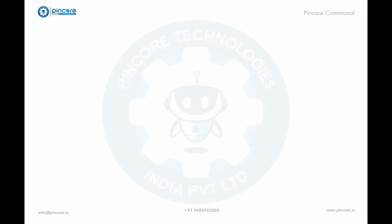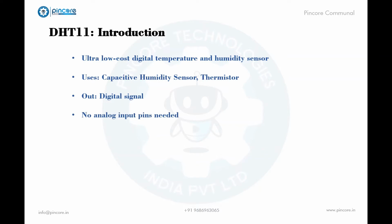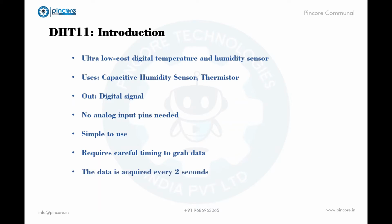So now let us discuss the introduction of the DHT11 sensor. The DHT11 sensor is a basic, ultra low-cost digital temperature and humidity sensor. It uses a capacitive humidity sensor and a thermistor to measure the surrounding air. It spits out a digital signal on the data pin, so no analog input pins are needed. It's very simple to use but requires careful timing to grab the data. The only limitation of this sensor is that you can get new data from it only every 2 seconds.